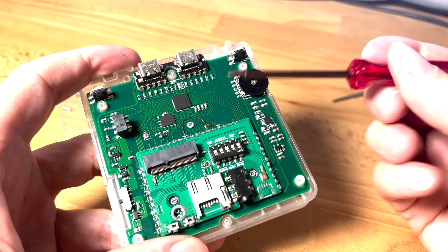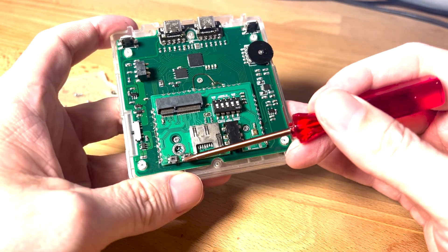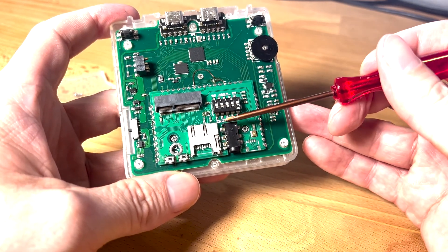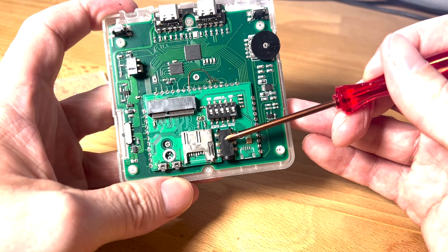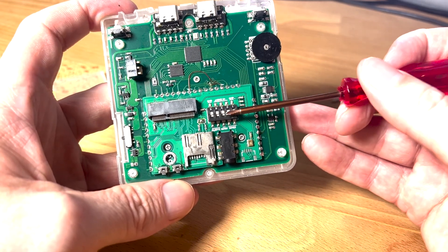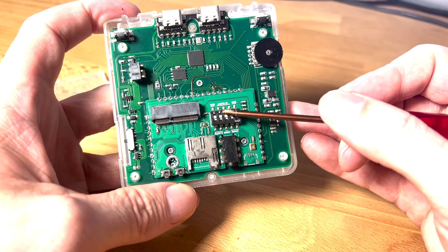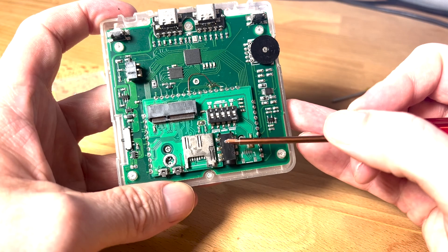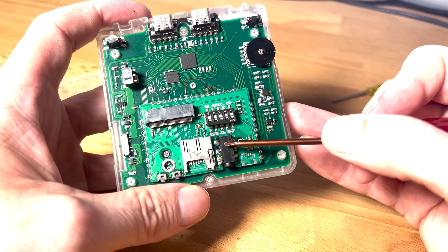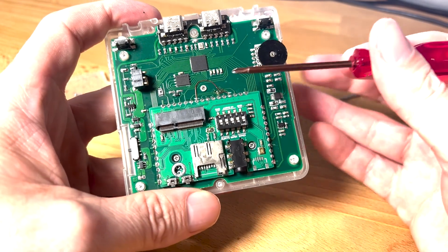This is an audio amplifier. And then this is the fun stuff — there's the SD card, a reset button, and a user button. If you wanted to use either an Android headset, PC style headset, or a Mac headset, and wanted to use the microphone in — or potentially configure it as a link cable since this is just GPIO — you could do I²C over this. There's also an unpopulated I²C header, and I put a little microphone on here just for fun.